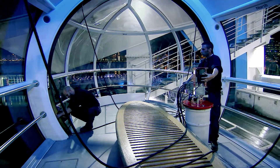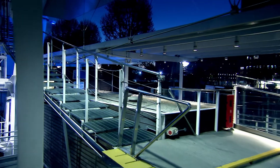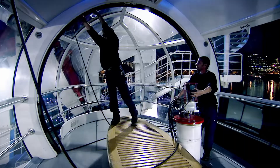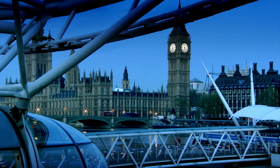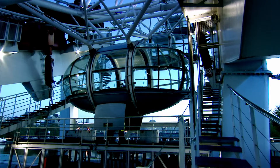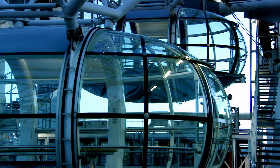It's 5am in London. While the city sleeps, maintenance engineers oil the bearings that keep the capsules turning smoothly. But working out how to actually drive the capsules around had designers scratching their heads. They could let them hang freely and rely on gravity to keep them upright, but this would only work with a one-ton counterweight at the base of each capsule — making them far too heavy. The solution is hidden beneath the capsule floor: an electric motor drives a set of gears that rotates the capsule, its speed synchronised with the wheel so the floor remains level all the way round.